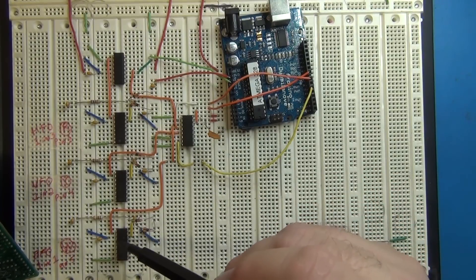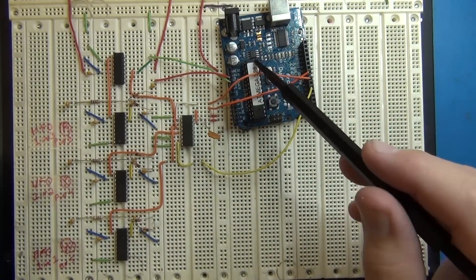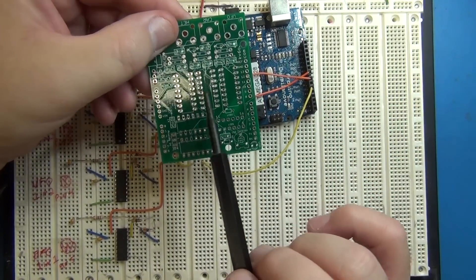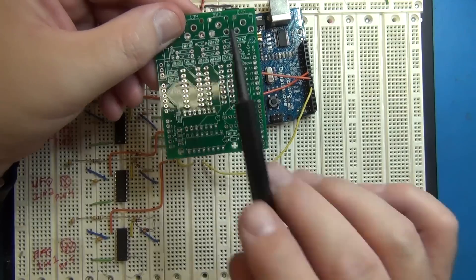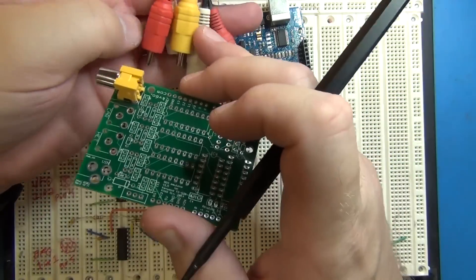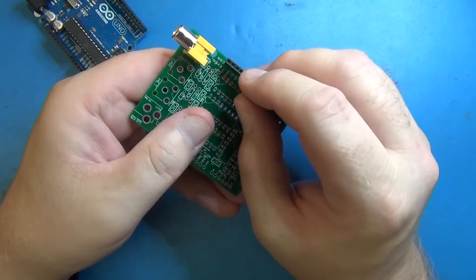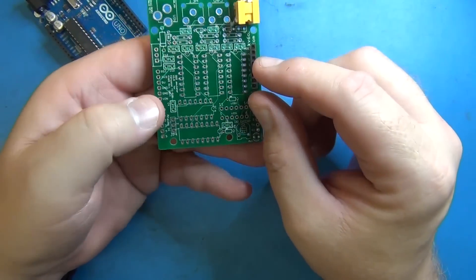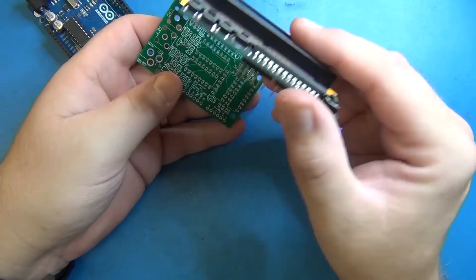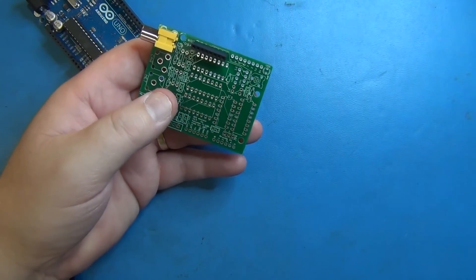A recap: this is the three phase-locked loops for the BFO, VFO, and HFO. The HFO has to go through a divide-by-eight. Those three signals go into a multiplexer, and the Arduino controls which one it looks at, one at a time, through the multiplexer to the timer counter pin. We have those three PLLs, the divide-by-eight, and the multiplexer on the board. The LCD plugs into the headers, and signals come in via RCA cables. My original plan was to put an Adafruit LCD shield on top, but Steve found the counting pin wasn't working with that shield, so he went with a simple LCD.